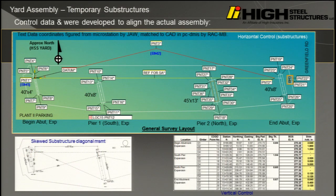Again, the ratio, it had a really long main span, and anyway, here are the false work layouts, and this is where we used metrology. It was really cool, rather than have to do the angle, bearing, and offset distance, what we did is I basically drew the model in horizontal control in MicroStation or AutoCAD, and then we exported a file, which we imported into the total station, and then we're walking around with a 360 prism, and it's like GPS mode.